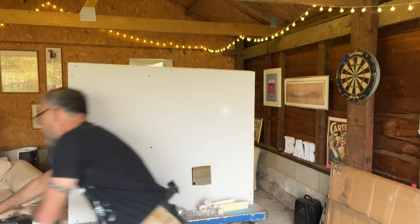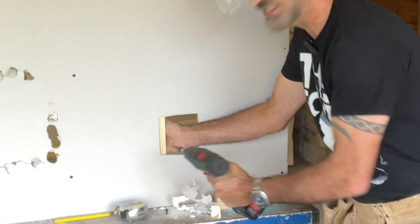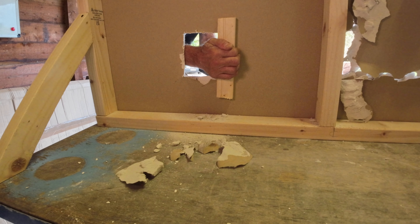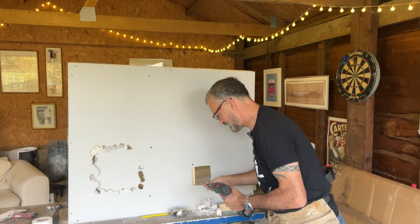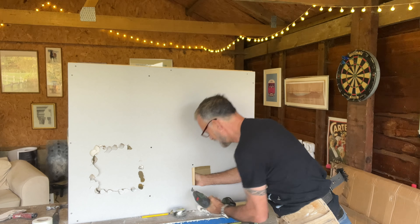Next it is drywall screws and your cordless drill. Ideally have a magnetic bit so it will just stay on regardless — they're brilliant. We will bring the timber in here and gauge where it is. You can see it's half on there and half off, and we screw into the top. We want the screw to go just slightly below the surface of the paper so we can fill over it. Do the same below — mind your fingers. Just below the surface. That's nice and solid. Then take the other one, two more screws, and do the other side.